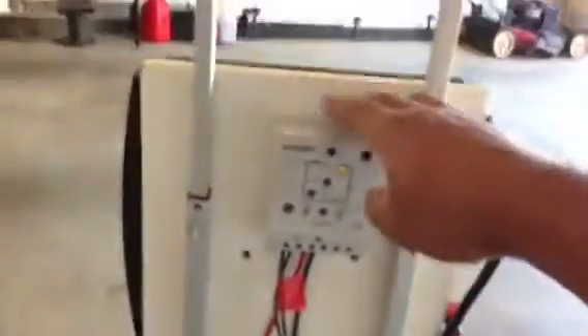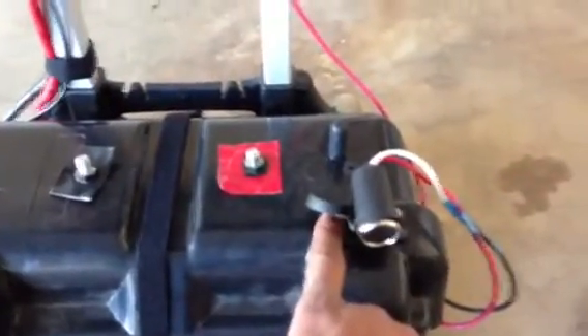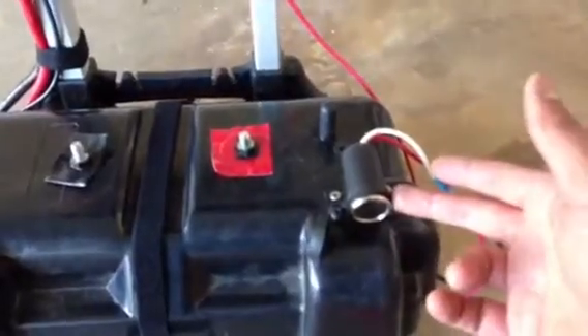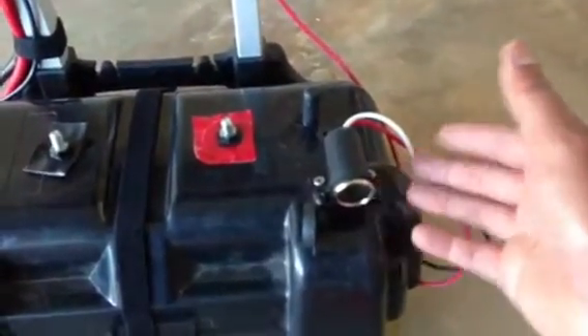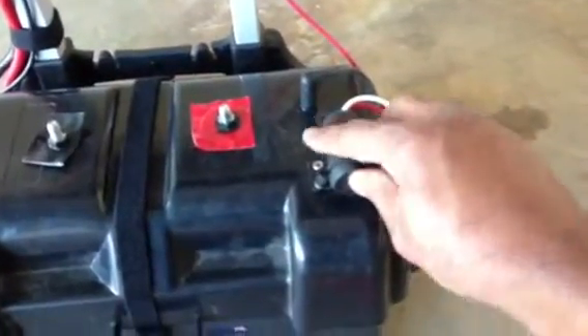Looking at this, you can see it's pretty simplistic. On the back I mounted a PWM charge controller, and it's connected to my battery. I also have a connection for solar panels if I wanted to connect one. On the front I have both positive and negative terminals, and I also have a 12-volt car adapter where I can either plug in a trickle charger, which I do on a daily basis, or I can plug in some other device to run off 12-volt power.